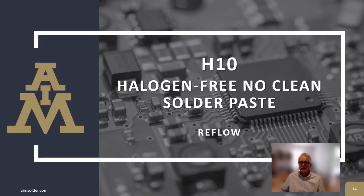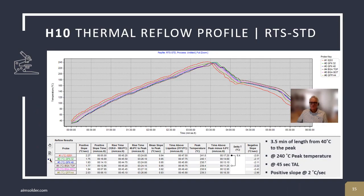Once a solid print foundation has been established, the next area of concern is reflow. The only step in an assembly process that we can manipulate in real time to result in a different outcome is reflow. So a wide process window is essential in creating a solder paste that will satisfy a wide variety of users' needs. This profile is referenced as an RTS, or ramp-to-spike profile standard, meaning that the peak temperatures are achieved between three and a half and four minutes. It's a linear profile with no soak zone, with a straight ramp to peak.